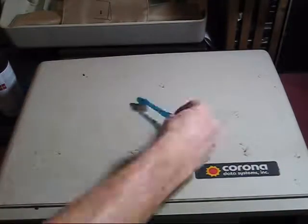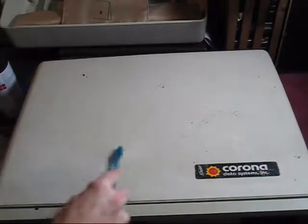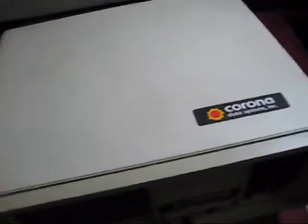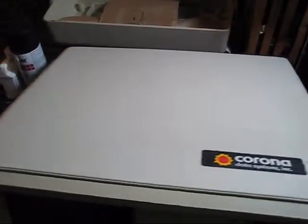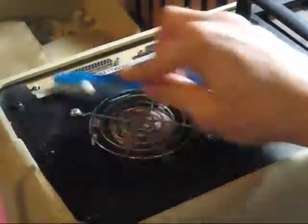Now that we've got a fully functioning PC, let's try and make it look a little better. I started trying some all-purpose cleaner with a toothbrush to loosen the dirt from the texture of the plastic and then wiping it off with a paper towel. This seemed to work okay but it took quite a long time and there's still some stubborn spots — even after all that scrubbing there's still some darkened residue. It did reveal one rather prominent scratch, but unfortunately there's not much I can do about it. I tried a magic eraser on one of the scuff marks and hey, that works 10 times better than the toothbrush. So I went ahead and scrubbed the top again with the eraser — wow, that really does look a lot better. What I'd initially thought was yellowing from UV was actually just nicotine buildup.